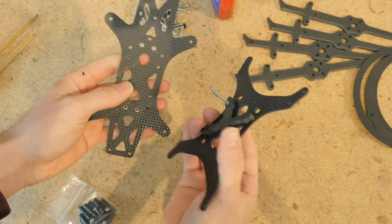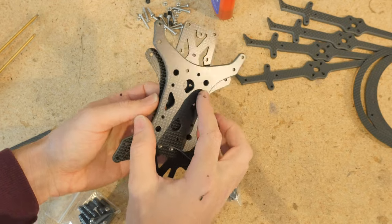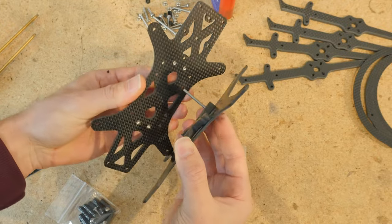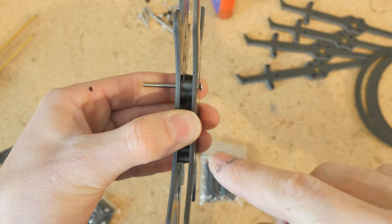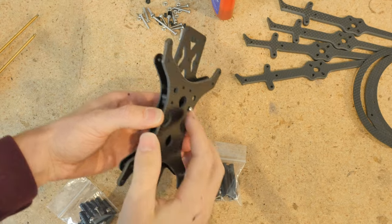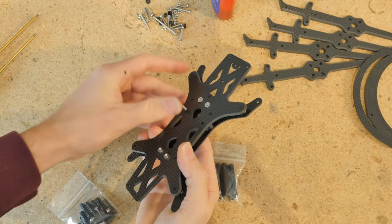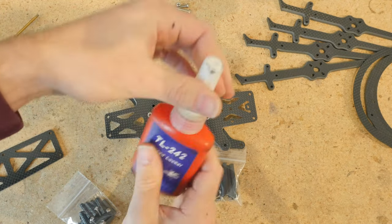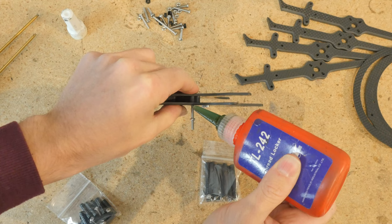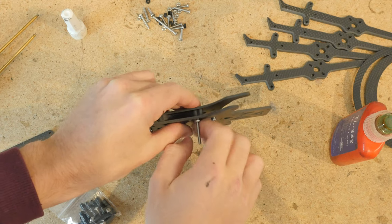At this point the orientation doesn't matter, as long as the torsion brace is located properly. I put it in the wrong hole — let me try that again. There we go. Looking closer, make sure the chamfers for the sandwich plate and the top plate are facing outward. Now that we have our first 35mm screw through there, let's put on an M3 hex nut. At this point you should start Loctiting things. Even though we're not tightening things yet, just place a little dab — a dabby-dab. Then thread that down just so it's barely hand tight; it may benefit from being a little bit loose.